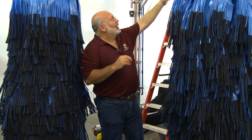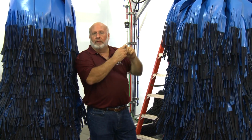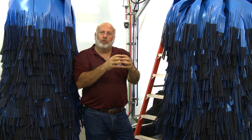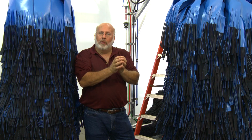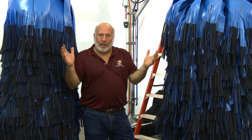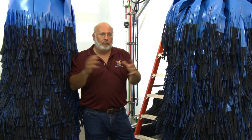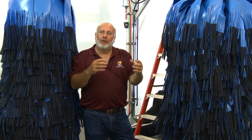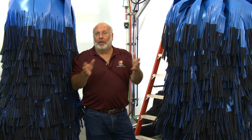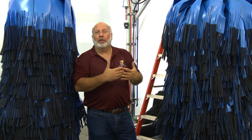If you really want to check everything else out, we can go up top, release the air pressure, pull the pins, and like I said, the shock absorbers are gas-powered shocks, so they're always going to try to extend. If, when you take it apart, it doesn't extend, it's actually lost its gas, or the bladder has been ruptured, it'll just be stationary wherever you put it. That's an indication that your shock is bad, we need to replace that. And that makes a lazy brush.